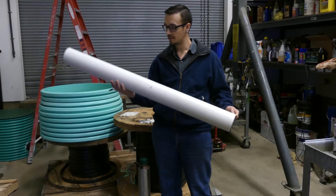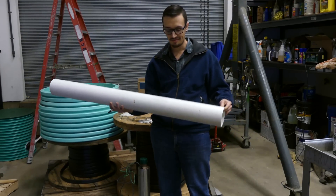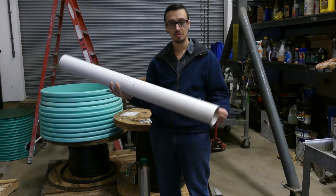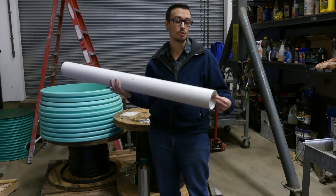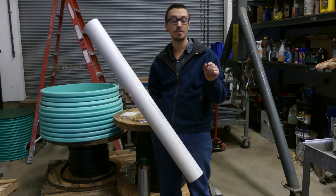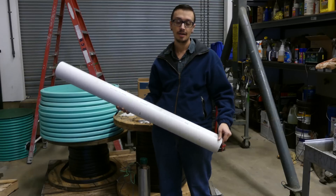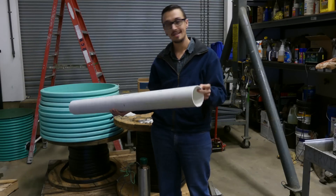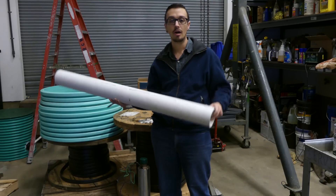What we're going to use to get started here may look like your everyday schedule 40 PVC, but it is in fact SDR 35 pipe — a low pressure drain pipe. The reason we can't use schedule 40 is because its wall is too thick and the motor actually doesn't fit in there properly. So we use this slightly thinner walled material and we're able to fit the motor in and accomplish our goal.